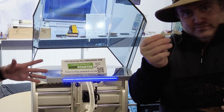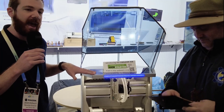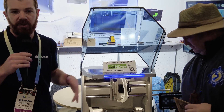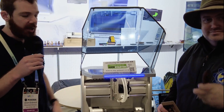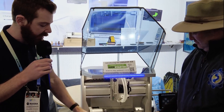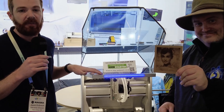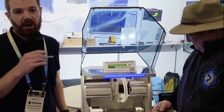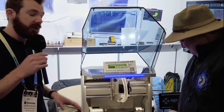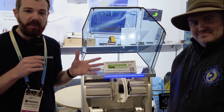Unlike the Carvera, the precision is a little bit lower, but it's still very, very, very aggressive precision and excellent quality for our entry-level enthusiasts, DIYers, and schools. This can also do fourth-axis machining like the Carvera, and it also has the same type of calibration and probing features, which makes it a very user-friendly and versatile machine. You can do laser engraving as well, though the laser engraver is an attachment — an accessory that you can equip rather than being permanently built in.